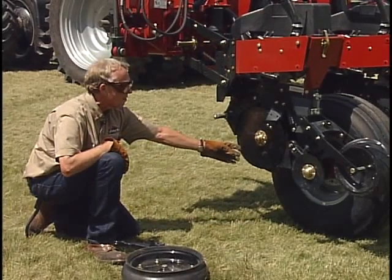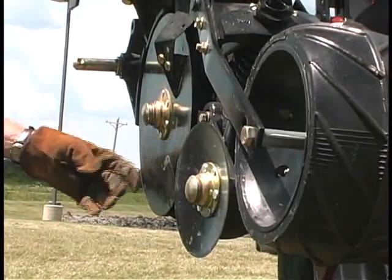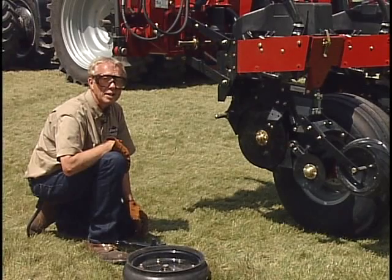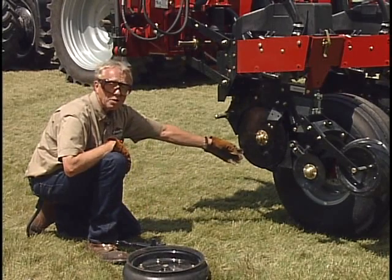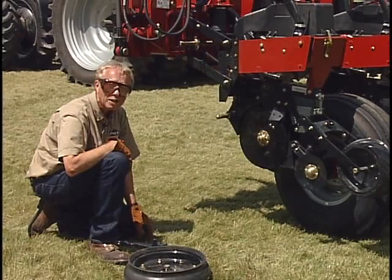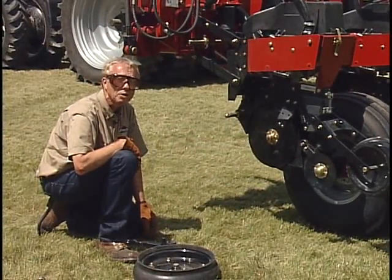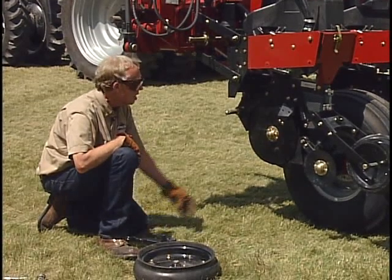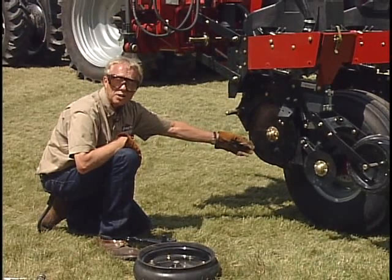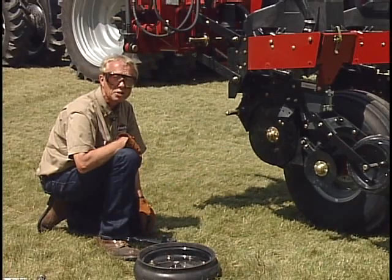We talk about having a nice, sharp entry point right here at the soil entry level — if you think about this as a clock dial, about the 8 o'clock position. In this case, we don't have these coulters touching, or they might just be barely touching. The specification in your operator's manual goes up to about an eighth of an inch. Basically, you want that trailing coulter operating within an eighth of an inch or less — say, a sixteenth of an inch — of this lead coulter, operating just in the shadow of it.